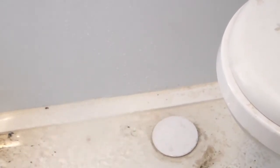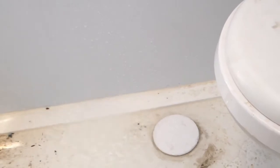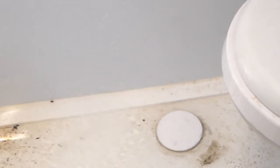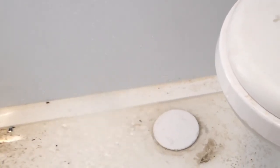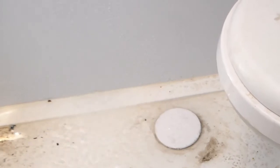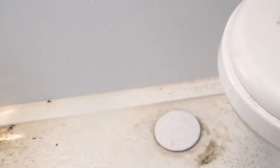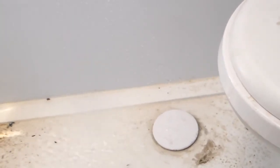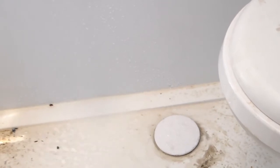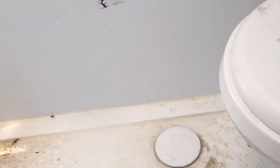It will, I promise you. Hold your breath. Just takes a second for the pump to prime. There we go. So now that water's been sucked in there quite good. And that pump that's draining that away, the flow rate is exactly the same as the pump that's providing the water. So you'll never have a backup of water at this end.